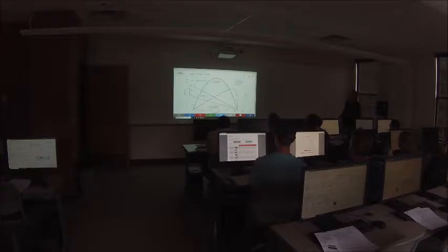Now, the nice thing about this is that it's a straight line, right? It looks like a straight line, it is a straight line. Now, in real life, there might be a little bit of noise just for manufacturing variances, but for all intents and purposes, it's a very straight line. So it's what we call a linear relation, right? If I increase my speed by 10 RPM, the torque that the motor is outputting is going to drop by some amount. If I increase by another 10 RPM, the torque is going to drop by that same amount. If I increase my speed by 20 RPM, my torque is going to drop by twice that amount. Right? That makes sense. It's a linear relation, so it's just basically multiplication.